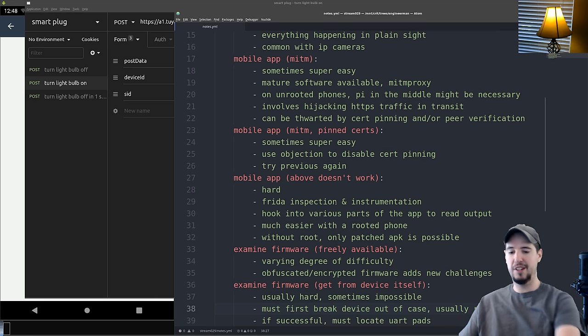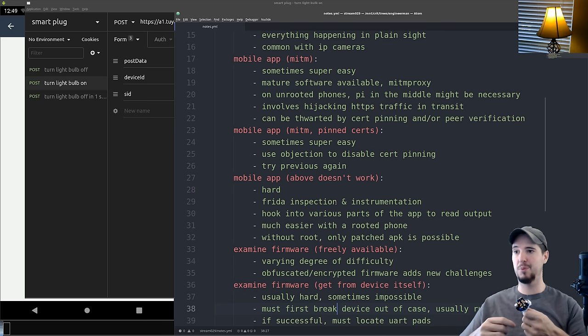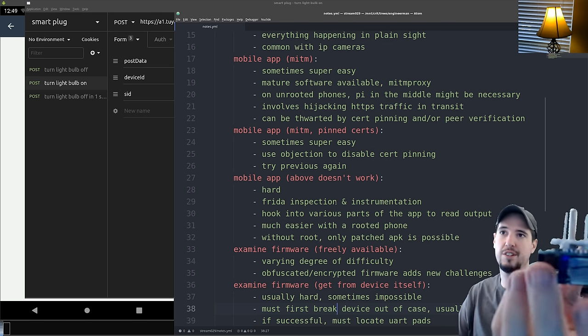The problem is, what we did is we looked at what the Android app was sending to the Tuya US endpoint. What we didn't look at is what the Tuya US cloud server is sending to this thing. And that's because this is even harder to tap into than an Android app. There's no Chrome DevTools for smart plugs, for instance. So for us to look at what's inside this plug, we have to actually get access to this Wi-Fi module here. So that little guy.